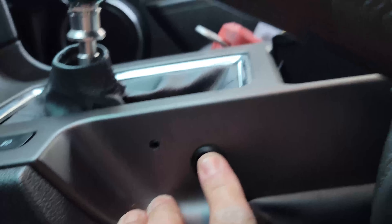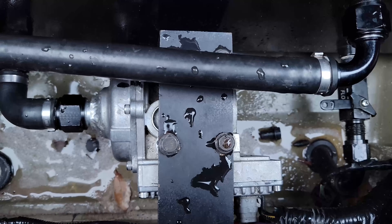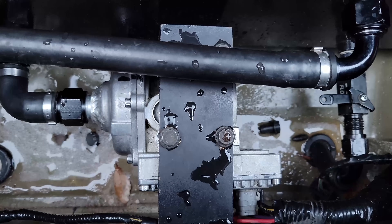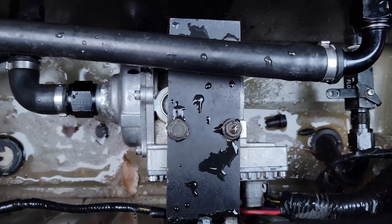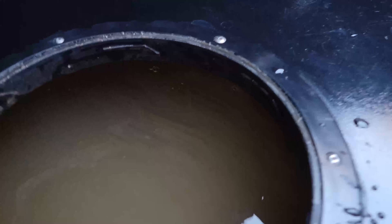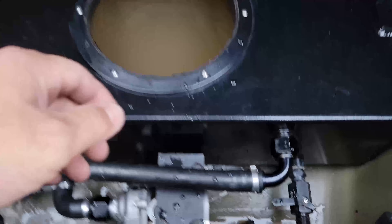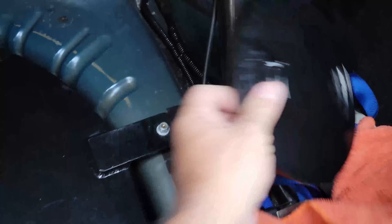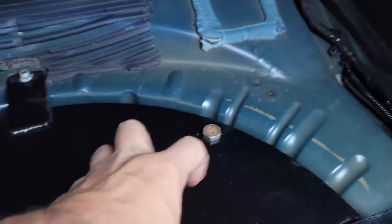I'm trying to get the pump to prime — it's definitely hauling. There it is — beautiful. Okay, taking it for a drive. The two holes drilled up here relieve any suction since this was plugged before. Let's see if that fixes the issue. IAT2 — the bottom number is the cold air temp. I'm hearing the pump do something a little weird.